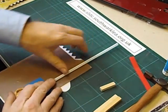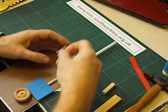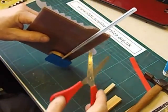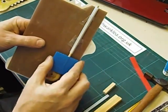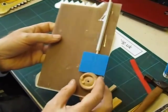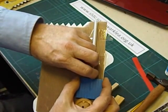Put it on the table and stick down the straw with two bits of sticky tape — one near the top and one near the bottom. We now temporarily remove the follower so that we can cut the straw off level with the top. Put the follower back in again and now we should have the stick coming out of the top. When the cam is at its lowest point the stick should be level with the top of the straw, and we can adjust it by sliding it out of the follower.